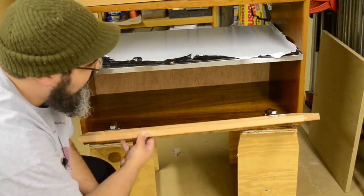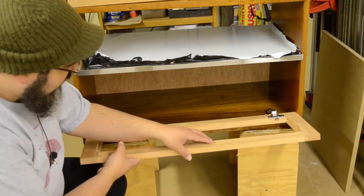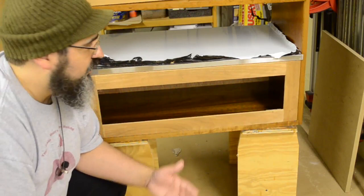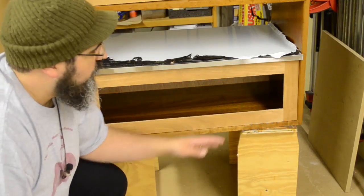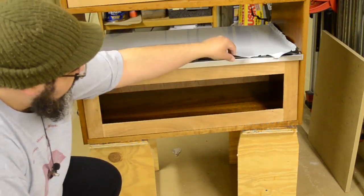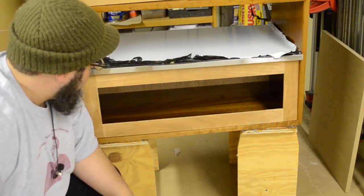For the bottom flip-down door we did almost the same thing — worked the edges for the reveal, installed adjustable hinges. One big difference: the door starts closing on its own. The client wanted soft-close so it doesn't slam, and these hinges are strong enough for that once the insert is in place. We also talked about adding some cam action to prevent it from flipping too far forward. And this is just the protective covering on the stainless steel — I wanted to reveal it to confirm it matched the cabinet, and it did.